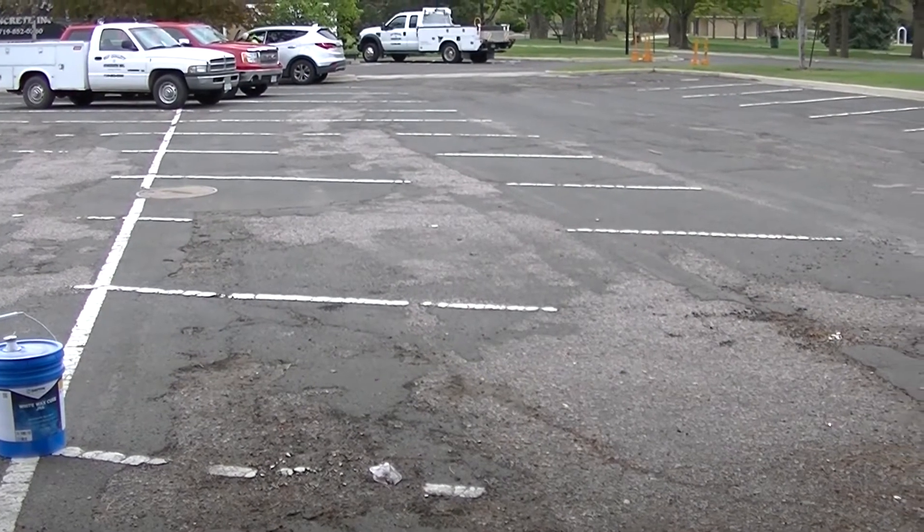As you can see from the elevation of this Brookshire Park parking lot, the pavement is very level. So the city of Thornton was very interested to see if we could correct the drainage of this parking lot so it flows off without continually damaging the pavement. We're going to showcase how with concrete paving and a 3D laser screed, we can pour the concrete very accurately so the flow goes exactly right to where we want it, and they'll give you a long-lasting finish.